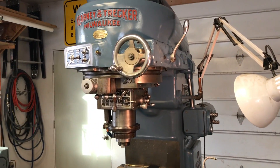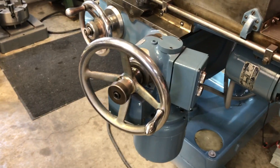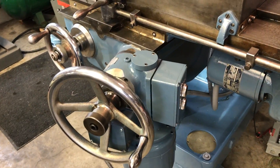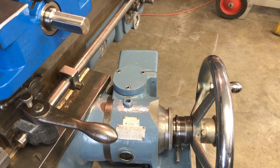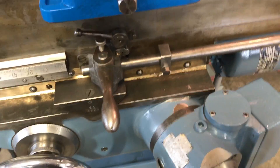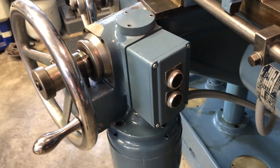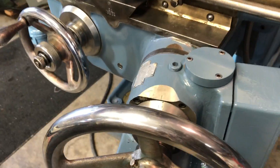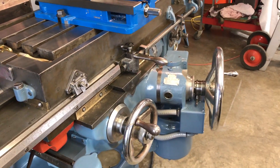This machine is a 1952 model. It has a knee lift on it but this isn't a factory knee lift — it's an aftermarket one. I'm glad it has it, but it sticks out a little further than the factory one. Instead of a lever to pull in and out for up and down, it just has two buttons — an up and a down. The downside to this one is there are no limit switches on it, and I'm in the process of putting some limit switches on it so it doesn't get run up or down too far.